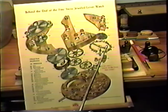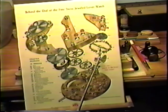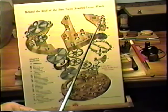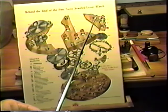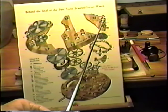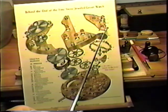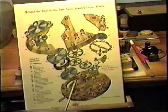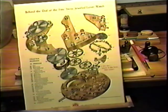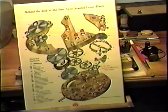You can clean the balance all in one unit. It consists of the balance wheel, the balance staff, the roller table with a jewel, the hairspring with a hairspring stud, and covering all of that is the balance bridge with one screw. The regulator, the hole jewel, the cap jewel, and the stud screw — the stud screw is for when one end of the hairspring is put into the stud hole, and the screw locks it in place. It's good practice to memorize these names so that when you have the watch apart you don't have to refer to the charts too often.